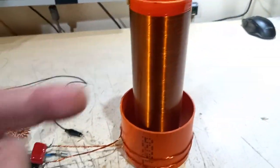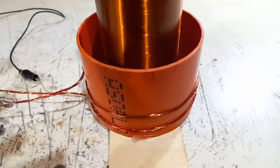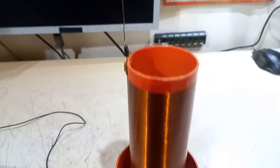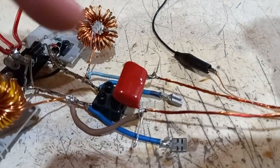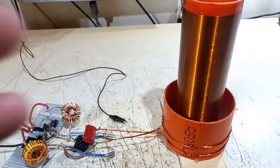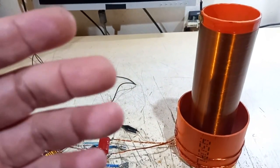I'm again trying a ZVS driving a solid state Tesla coil. Here's the ZVS, and here's the Tesla coil. A couple of weeks have passed since my last attempt, but today I made some improvements. First, a larger primary — this works a bit better — just two turns with solid wire instead of stranded; I probably should have used copper pipe because the currents on the primary are insane. No top-load, which gives a higher resonant frequency but probably less selectivity. I made better solder connections for the capacitor and primary, and now this runs at 19-20 volts out of my bench supply, still maxing out at around 5 amps. I don't really like this type of coil because it's very hard to tune, jams easily, and the performance is only relative.